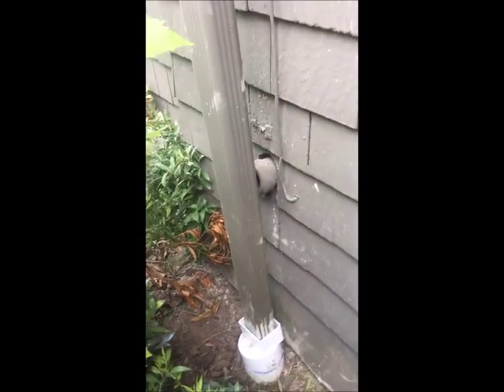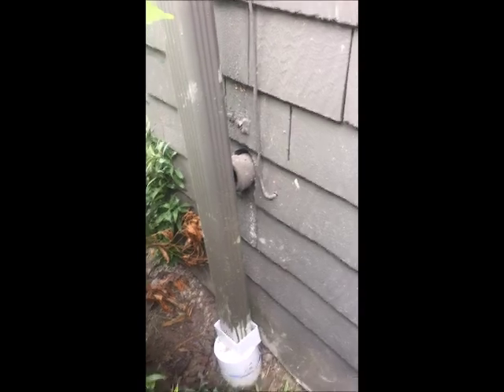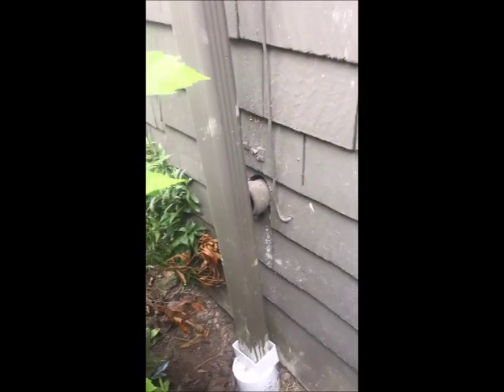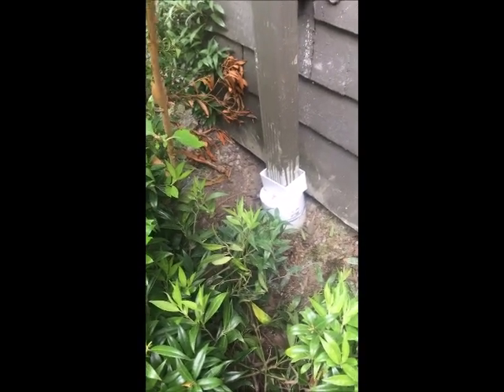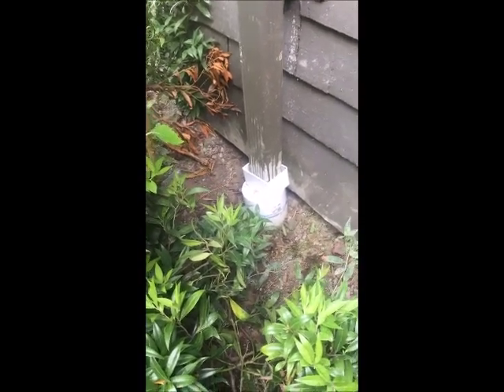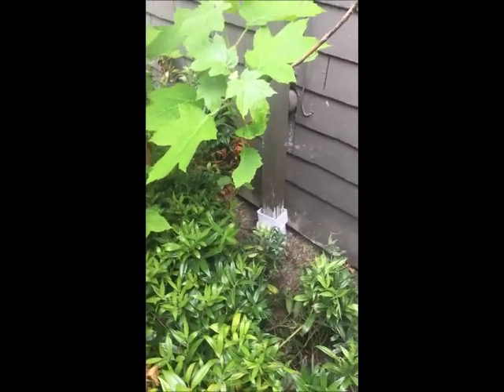Also, this pipe poking out — this pipe needs to be sealed on top. The one behind the downspout pipe. They use polycoex pipe for the downspouts; it does not glue well. Those fittings are already kind of loose, so that itself can lose roof water.